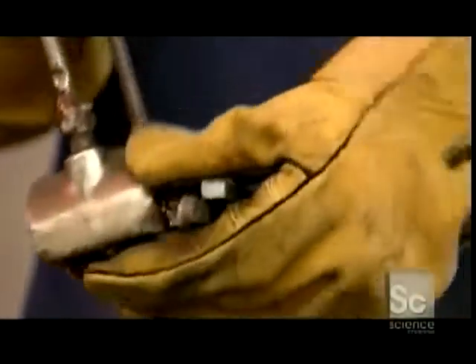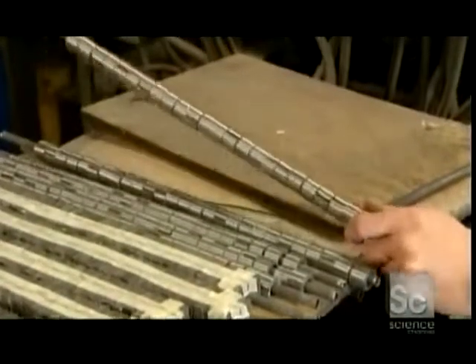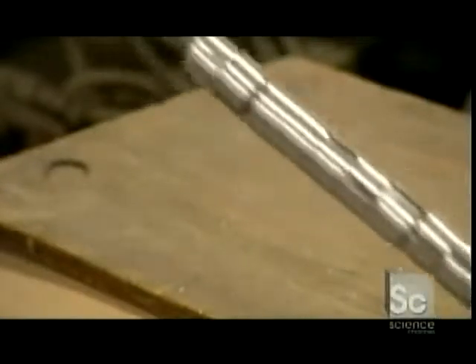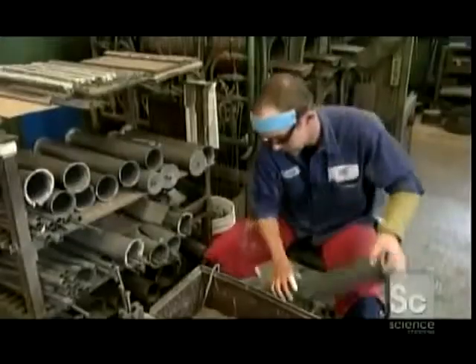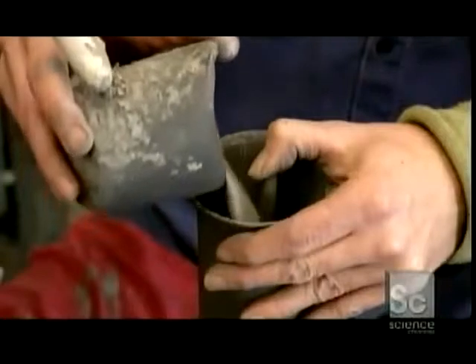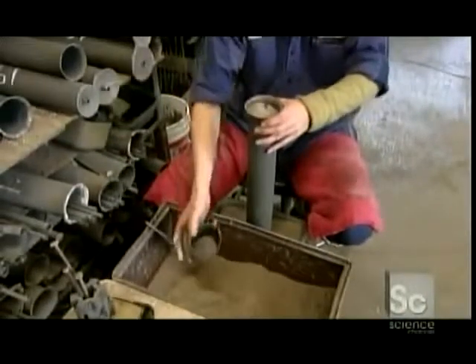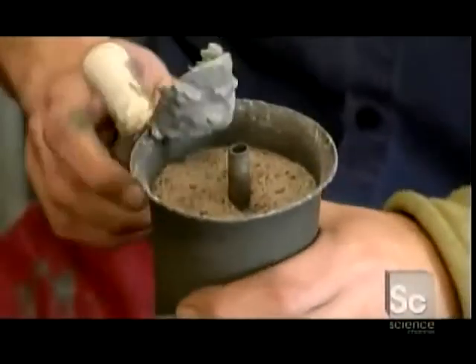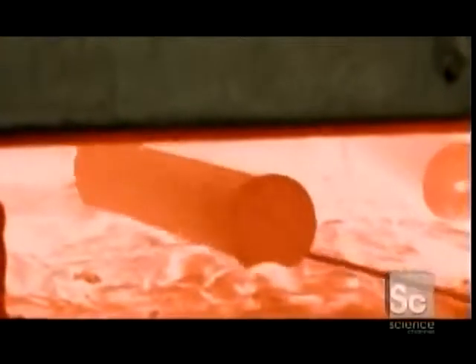But these metal pieces aren't yet magnetized themselves — that will come later. A set of rings, designed for use in electric motors, is threaded onto a copper pipe. The ring-covered pipe is placed in a tube, and then silica sand is packed in to hold the rings in position. Both ends of the tube are sealed with concrete, and then it's into an electrical furnace.